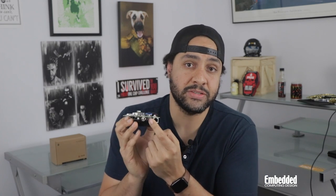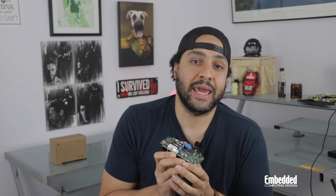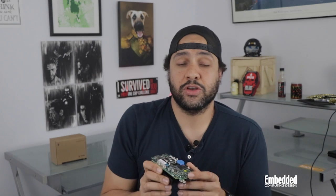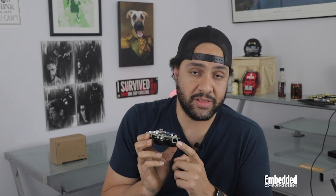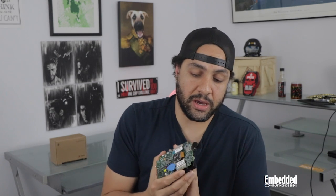Much of this is handled by the remarkable onboard USB Type-C interface, which functions as a 30 frames per second 1920 x 1080 DisplayPort interface, as well as a power supply, should you choose not to use the 12–24 volt DC terminal. The USB Type-C port also handles standard data transfers over integrated USB 3 and USB 2 lanes. There's also a 10/100/1000 megabit Ethernet port over this RJ45 LAN port, eight DIOs and a UART on these headers, an additional USB on-the-go port, and even a microSD slot for added development flexibility.